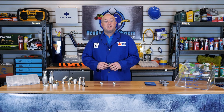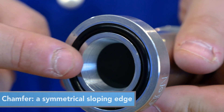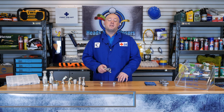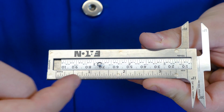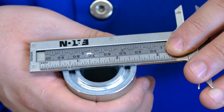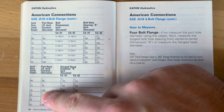The split flange connection is easy to identify because of its very unique design. It has a threadless design with an o-ring in the face of the flange that creates the seal. You'll also notice a slight chamfer on the inside of the fitting, which allows hydraulic fluid to flow easily and create less friction and therefore less heat. To determine the size of the connector, we measure the porthole diameter using the ruler part of the calipers on the face of the fitting. Here we get one inch, which, looking in our identification book, corresponds to a dash 16 fitting.